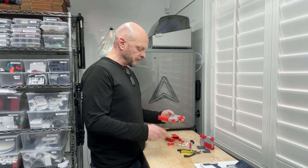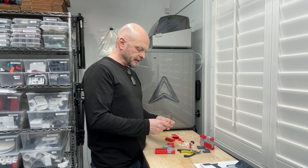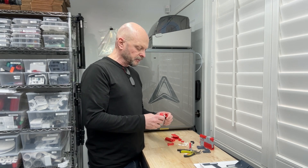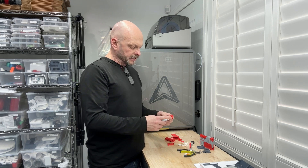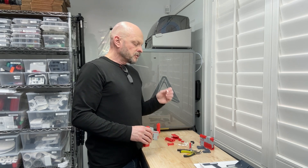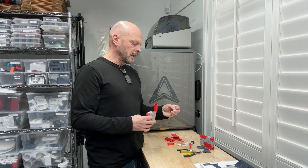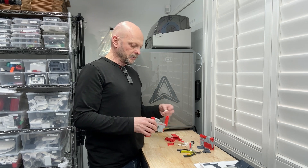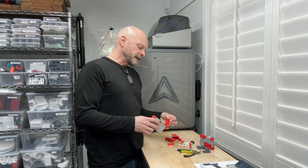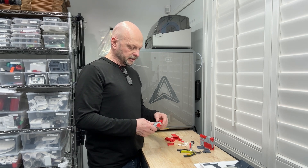I thought about rifling the inside of the barrel. I actually started with an eight-sided projectile, but when you print that on its side, you don't get perfectly equal sides, and I found that affected travel down the barrel. The barrel is also eight-sided. I subsequently switched to round projectiles that print standing up — they print really well. Print at 100% infill and randomize your start/stop. If you don't randomize it, you'll get a line where the start/stop is, which can be a problem traveling down the barrel and can take the projectile off balance.